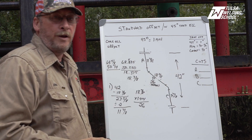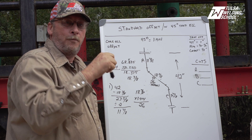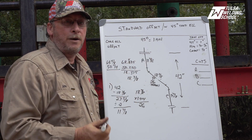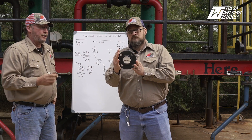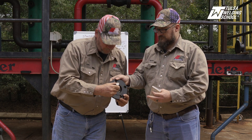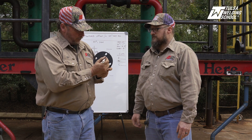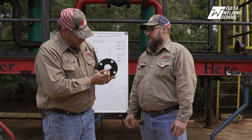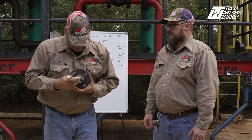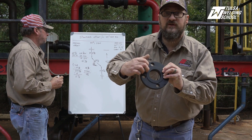On that kind of joint fit-up you have a quarter inch up to a half inch — what we call pullback. When you put the flange on, you have to have a pullback inside so that it can be seal-welded inside. With the slip-on flange we're using today, the pipe actually goes through the flange and you have to be able to weld a seal weld inside. If your pipe is flush with the flange face, the weld will go out onto the seating surface — and we never want to damage the seating surface on a raised-face flange, because that's where our gasket seals. You'll be pulling that pipe back a quarter to half inch so a weld can be put inside, and then welded on the outside too.